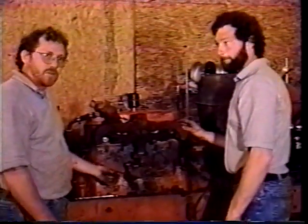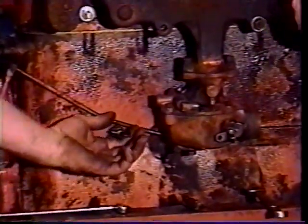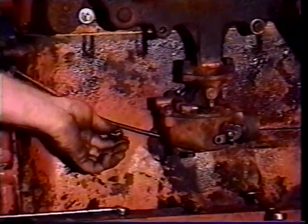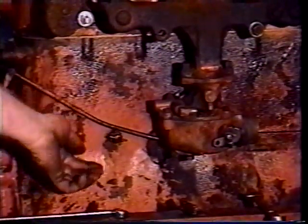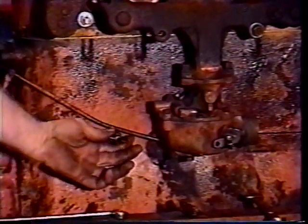And also while we're over here, this is where you drain the block of water. You might have drained your block of water. You're going to be getting the radiator on pretty soon, like you put the water pump on. You want to make sure this petcock's closed. When you forget about it, you end up having water pouring out when you start filling the radiator later. So while you're over here, or sometime during there, remember to close this petcock so you don't drain the water out on the floor as you start filling it back up.